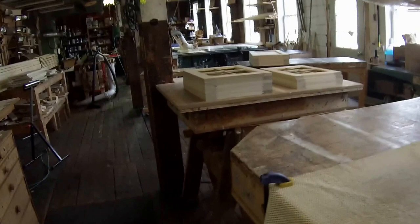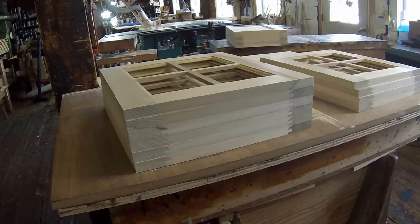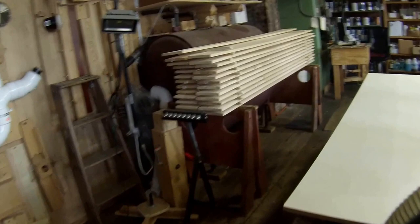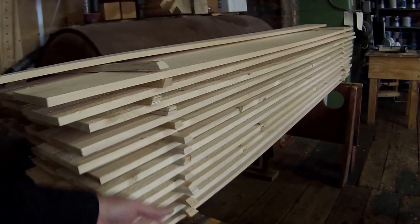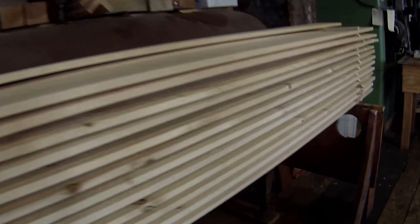I'm going to explain the steps I took to make perfectly flat doors when the finished product is all glued up. The material selection was done very carefully. The process started with buying rough-cut boards that were kiln-dried, and then I bring them into the shop and sticker them — that means putting little spacers in between so that airspace flows on all sides, and the wood dries out a lot quicker and more evenly, which is important.